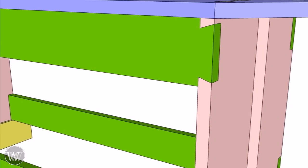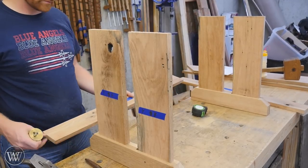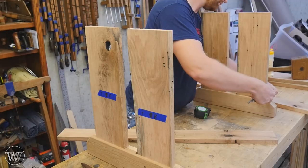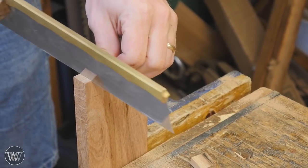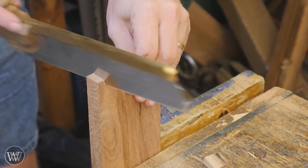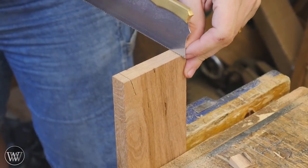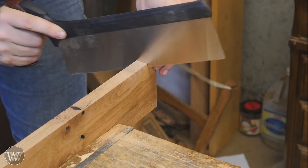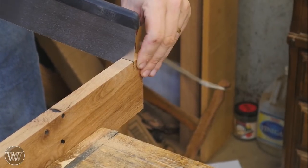Let's work on the stretchers. These stretchers go into the legs with dovetails. If you've never done dovetails before, this is a very simple dovetail — very easy to do. It just requires a little bit of layout. I'm going to use my marking gauge and mark the depth of the dovetail. Rather than making a measurement at three-quarters inch, I'm actually going to put it up against the leg it will be joining into and set the exact depth off of that leg, so if there's any variance I know it's going to fit perfectly. Then with that depth mark cut in, I cut the tail — I don't care what angle it is, I just want to make the tail look something like that. I'll cut either side at a slight angle, tipping it down in. Then I can put it in the vise at 90 degrees and cut the shoulder of these dovetails off — fairly quick and easy, just two slices in and you are left with a dovetail.